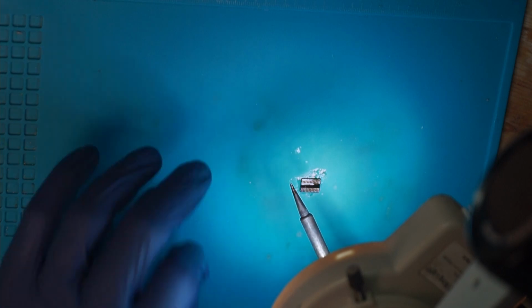Soldering iron wise, it helps if you have a little bit of a bigger tip, not huge, but not like the very fine tips, and if you have some power on your station. Otherwise it takes longer. Maybe if your soldering iron is really underpowered, you can also help a little bit with hot air.